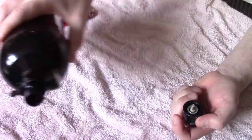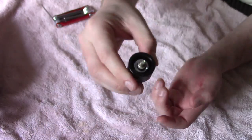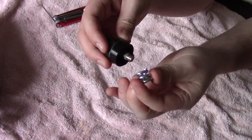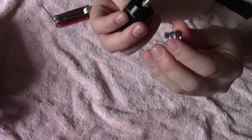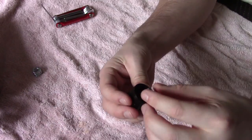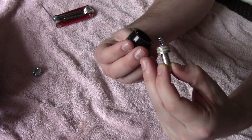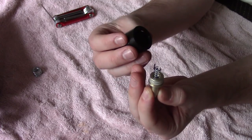There's the top — it's got a safety valve in it as well, and that's the inner part you're going to remove. You're going to take out the spring, and it's a tough spring — you'd never be able to compress it with your hands. Also in here is a little piston-looking thing. It's got some O-rings around it, a little spring inside of it, and also the ball bearing in there.